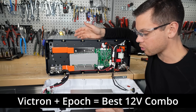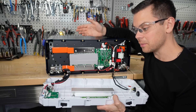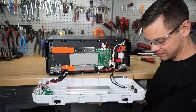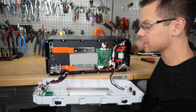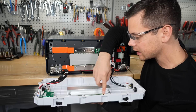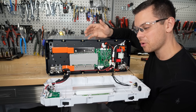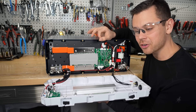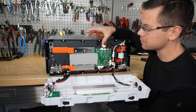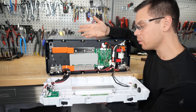I like their golf cart batteries and this manufacturer is fantastic — I actually want to use it. Most of these batteries I just throw in the trash after testing, but these ones I actually keep. I'm going to start using this in a system and get a larger Victron inverter to test even larger surge loads. Everything — even the seal on the lid — is built and designed specifically for this battery. It's about 30% more than a Litime, so if you want the cheapest option you could stick with that. But if you have a mobile application that needs durability or larger surge handling capability, this is the way to go.